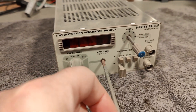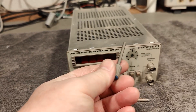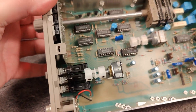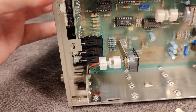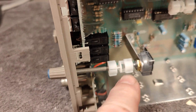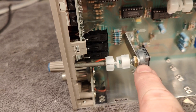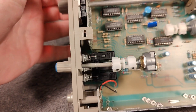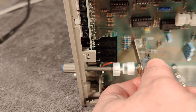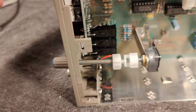It has something to do with those long sticky potentiometer shafts. It looks like stuff is broken from the outside, but let's open and have a look. And here is the problem. For some reason they really think this is a good idea with these couplers. But of course if this potentiometer is not at a perfect center alignment with the hole and the shaft and all that, the potentiometer will move a little. So that is why you use these couplers.